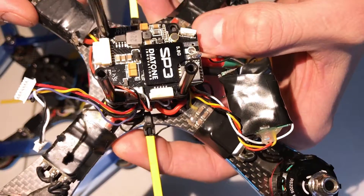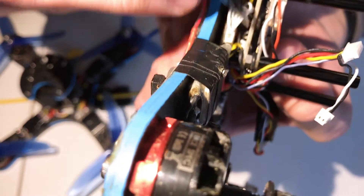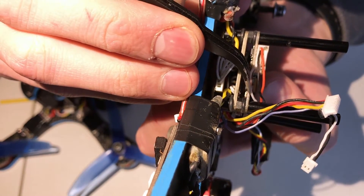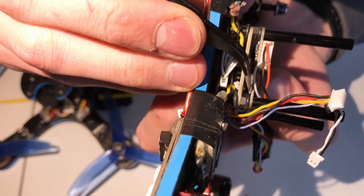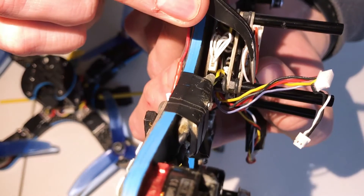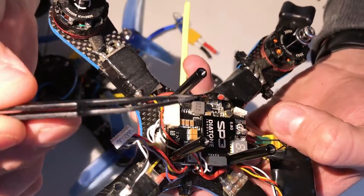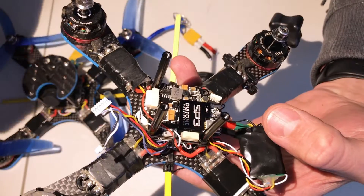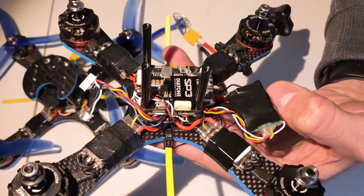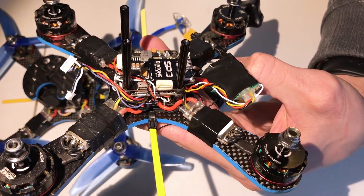You definitely want to make sure that when you do a stack, if it's as tight as mine — which is very thin, with one nut and a dampening pad — that you have proper separation. I had to put the dampening pad in to give it some extra room because my bolts aren't that long. I recommend getting as long of bolts as you can when building a stack or pod-style quadcopter, because these pods are prone to getting snapped off. Also, nylon standoffs are a no-go on pod-style quadcopters.